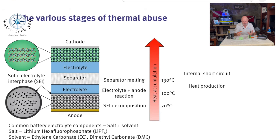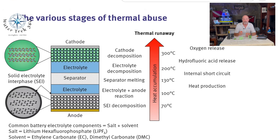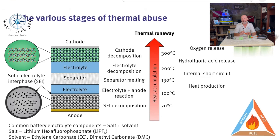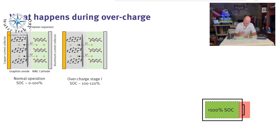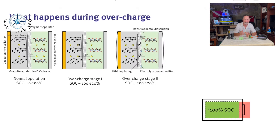The same applies to long-term exposure to the sun or an ambient working temperature that's too high — higher than normal tolerances of the battery, which is generally 40 to 80 degrees Fahrenheit. Avoid overcharging. Overcharge explosions can happen. When the charging voltage is greater than 5 volts, the protection circuit in the battery or the detection cabinet can go out of control. The electrolyte will decompose and violent reactions occur inside the battery. The increased internal pressure is not good.